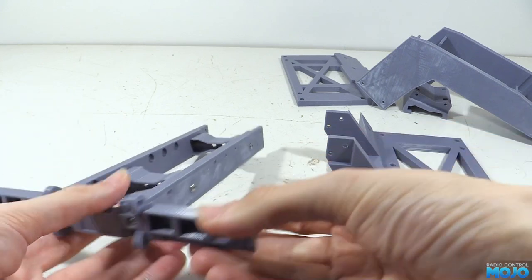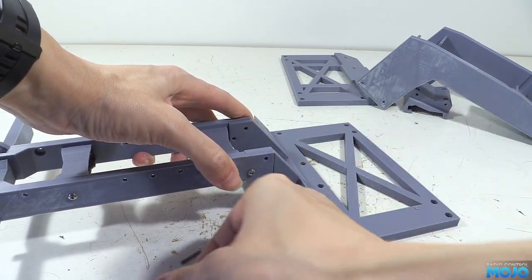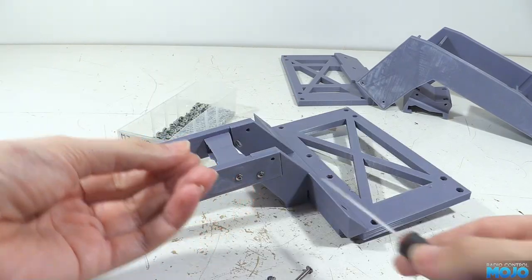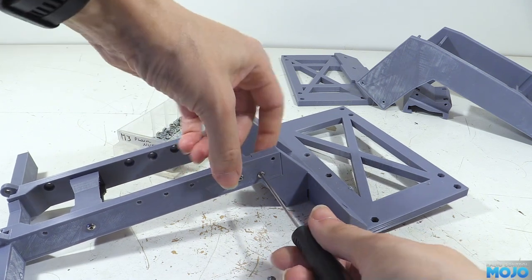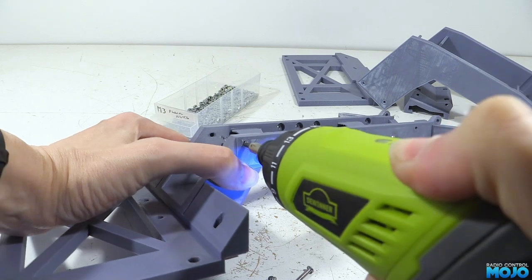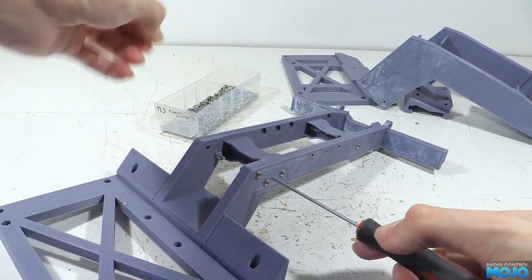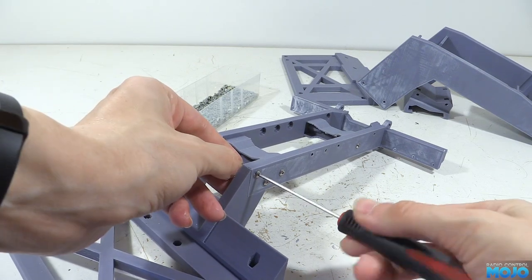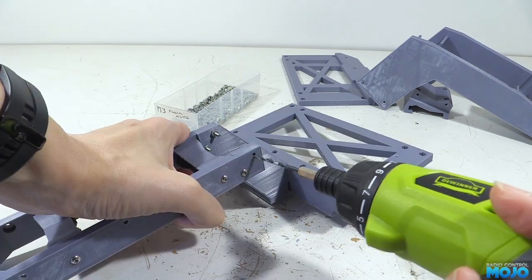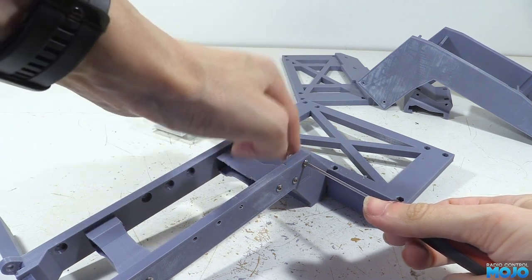The chassis offers up to the mount using two screws on each side. While the lower holes line up, the upper hole is around a millimetre out. There's a comment on the Thingiverse page suggesting there are some misaligned holes, but in this case it's fairly minor. If we use M3x16s and plain nuts in the bottom holes, we can use a 3mm drill to adjust the top hole. I'm using a cheap electric screwdriver; the included drill bit seems to be made of some sort of hard cheese — they all bent — but it does work for cleaning up holes in 3D printed parts. Now we can install two more M3x16s with nuts. We will be removing the top screws later to mount the dampers, but at this stage we just need to make sure everything's going to fit. I am going to be painting the chassis, so I'm just using plain nuts — the paint's going to gum up the threads, so I'm not worried about them coming loose. If you're not painting though, I would use some nylocks.